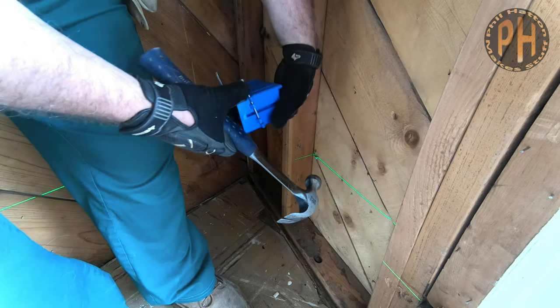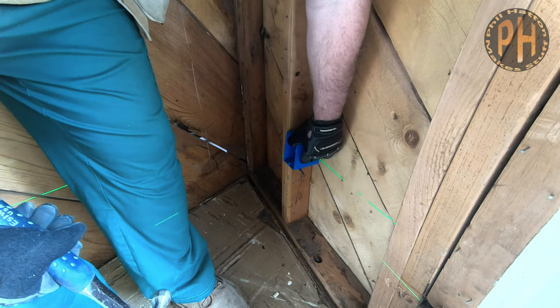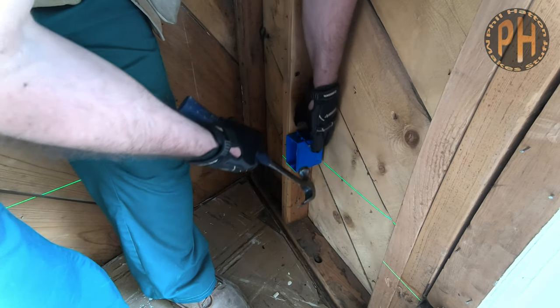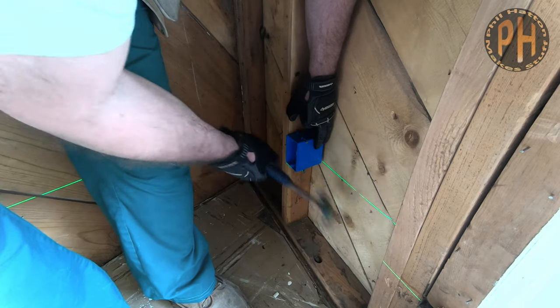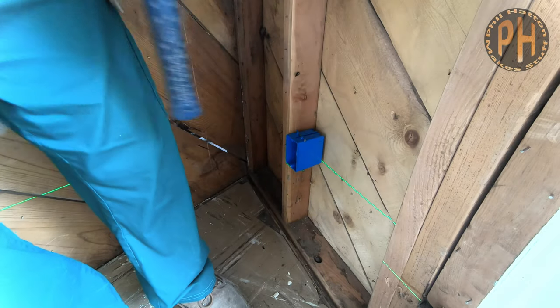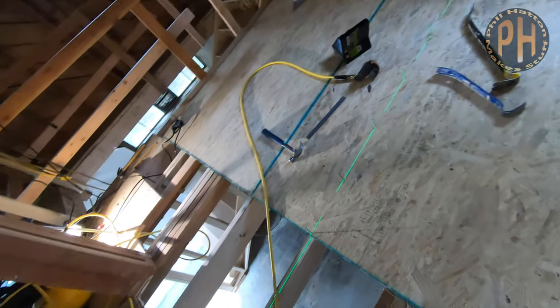I found a spare camera tripod and a couple of pieces of angle steel left over from demolishing the elevator were all I needed to set a level line anywhere I wanted. If the tripod wouldn't work because it was too tall, I simply screwed the angle steel to a stud and stuck the level on it using the magnet. I also built a short stand so I could stick the laser down low at the height I wanted to mount electrical boxes. It helped us lay out all of the walls we needed to build.